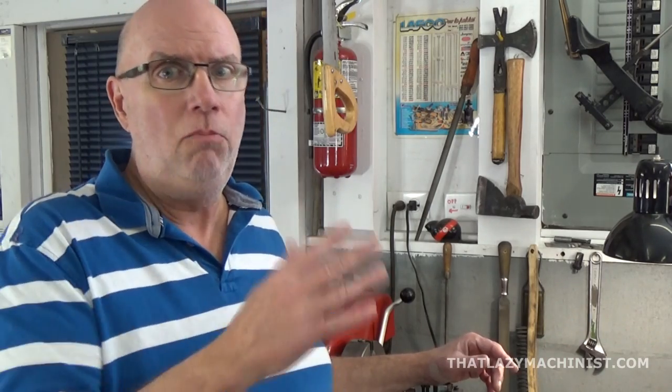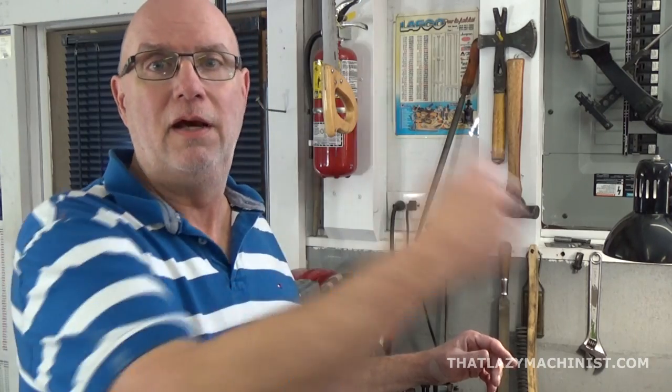There, my first lobe is cut. Now the second lobe is in the same position, but on the opposite side. The same 1,000th or 1 millimeter doesn't change at all, but I have to move the 1.73 millimeter to the other side of the axis of the part. That is going to be way simpler than what I did for the first lobe, because I'm already where I want to be with the 1 millimeter, and I know where that side is.